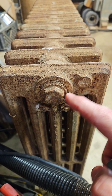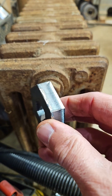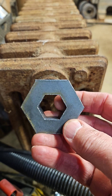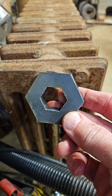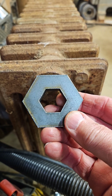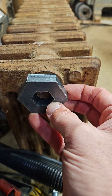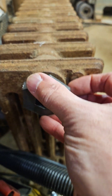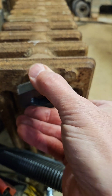So I came up with a trick. This is a piece of half-inch mild steel, and I made a hex to fit that plug. The OD here is for my largest three-quarter inch drive socket, which is two inches. And I made it a tight fit, so I basically hammered that on.